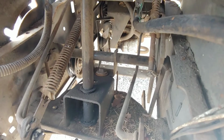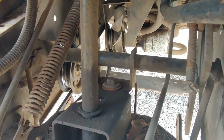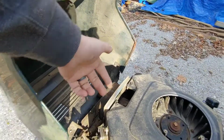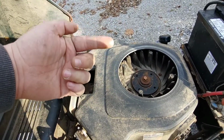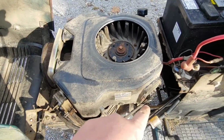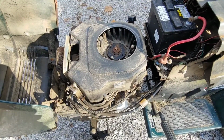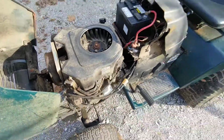It's going to be tight in there, but I think we've got enough room. Once I get rid of all the pulleys and the hydro setup, and you can see right there, the belt goes vertical. It's kind of weird. But I think we've got enough room to get the transmission squeezed in there. The diesel's going to sit at the front here with the output shaft facing backwards. We're going to do a little pulley, probably a double V-belt pulley on it, and a larger one on the transmission down there, and then use that as our clutch too, so we can just loosen the belts with a pedal, kind of like stock stuff. Just move it up top.